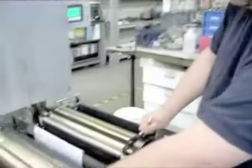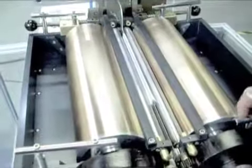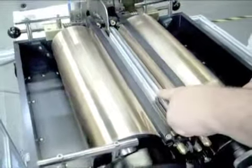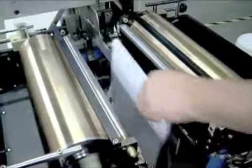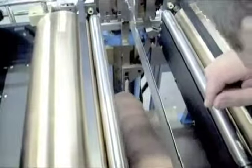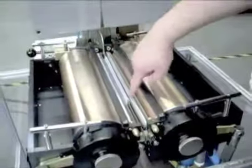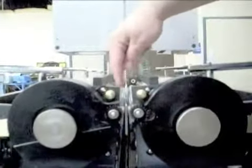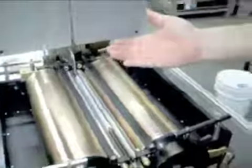You can see where the rollers are hitting the book — it's about 10 to 15 millimeters down the book. We have about 12 millimeters from the tangent point of the roller to the spine. If you need the rollers to be higher depending on the thickness or type of binding, or if you need the glue to come up higher, there's an adjustment here. That adjustment can be made while the machine is in operation.